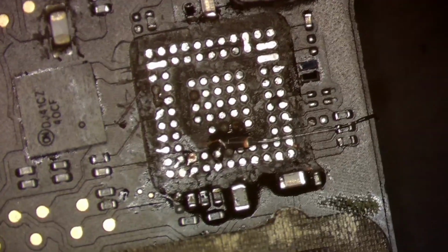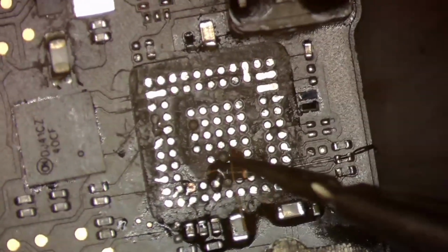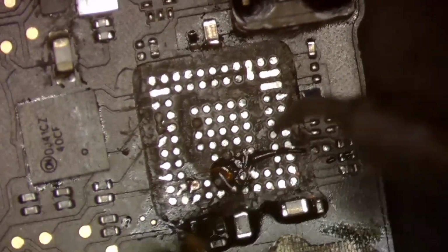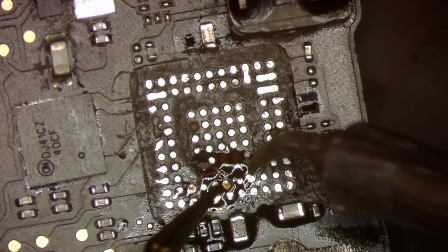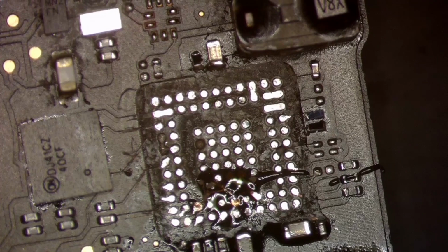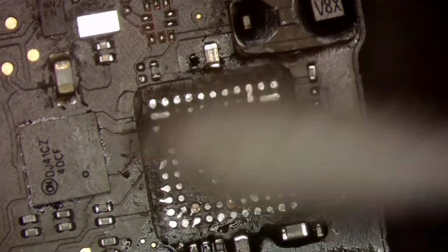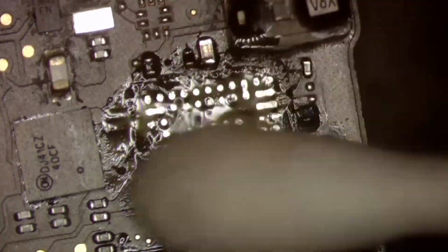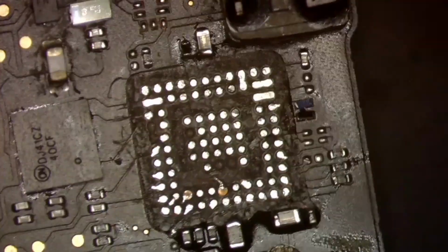We'll go ahead and put a little bit of flux there. Grab another one of these. Alright. Kind of put that one in place there. Perfect. And we will go ahead and solder that one too. Just like that. All right, and again, we're gonna try to put this in the perfect position on the board, just like that. And once again, cut off the tail. Perfect. And we will clean up our mess. Looking better. Perfect. All right. So now we have repaired those two pads.